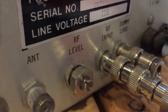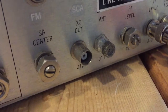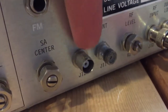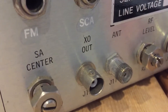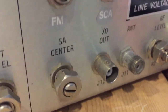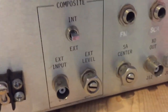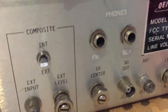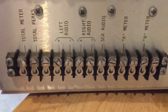The dummy load came with it — it's a BNC with basically just a plain resistor inside, very basic. There's also an RF level control here, and I had cranked this all the way up before getting the amp and it still wasn't sufficient. You can also hook this to an external antenna at the antenna input, so you can monitor multiple stations just like on a basic T antenna. There's a headphone jack so you can pull FM audio using the modulation monitor as a receiver, and there's a barrier strip on the back where you can connect any of the front dials and meters externally.